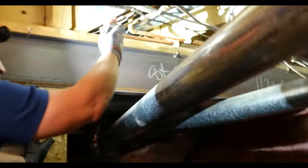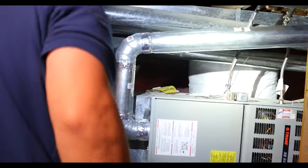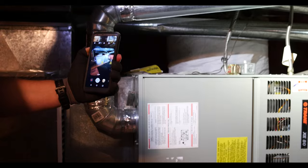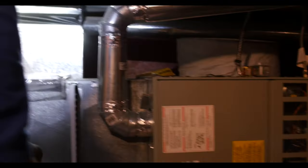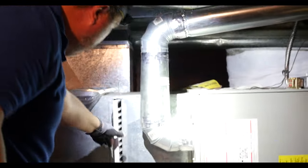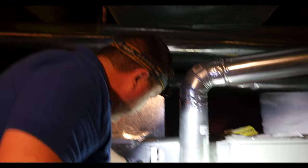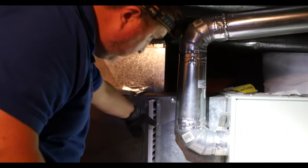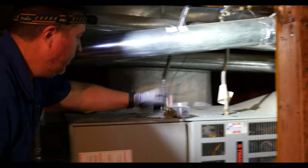While you're down here you can document what type of plumbing distribution they have — all appears to be copper. If you're going to do a sewer scope, look to where the clean-out is. Check the receptacles. Take a picture of the furnace before you get to anything. While looking at it — giving everything a once-over — it looks like they used a bigger filter here, and it looks like when the HVAC technicians were in here they didn't install a door, so it looks like they've just got this put in there.